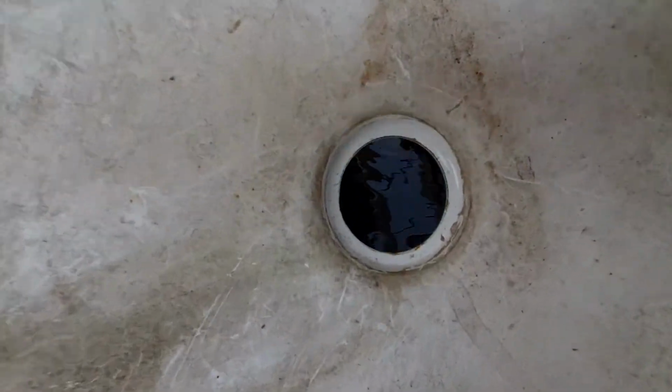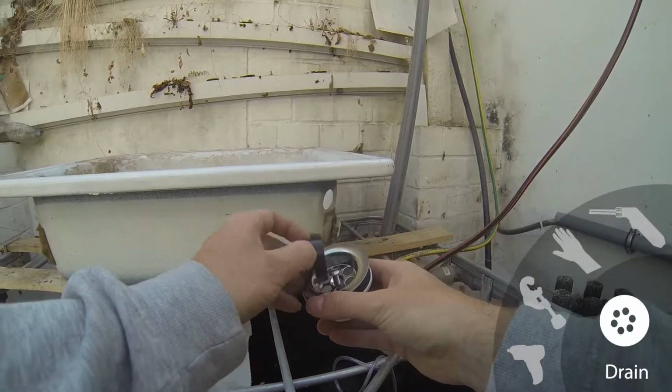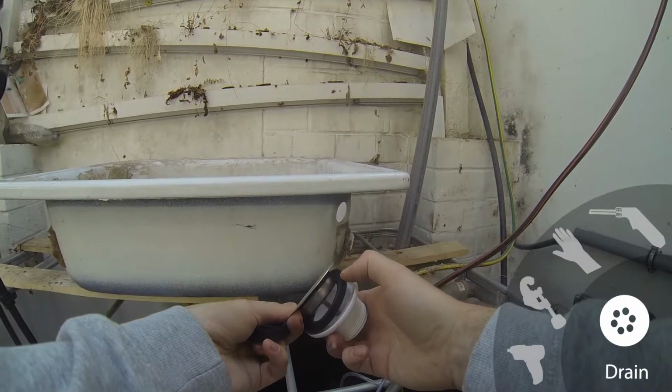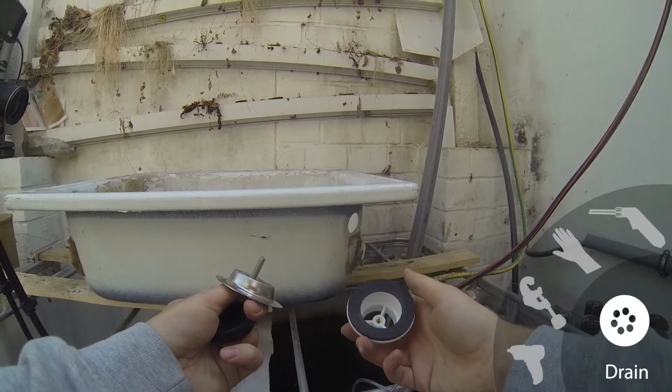This will save future catastrophes and also some water. The drain is a simple shower drain, which consists of 4 parts and a screw. The plastic part with the seal ring will be placed onto the hole from below the basin, and the metal part will attach from the inside. The screw will tighten the drain around the lip in the basin and hold it in place. It will also seal the drain.